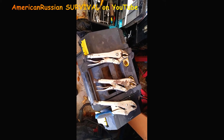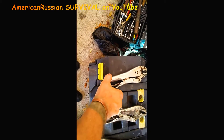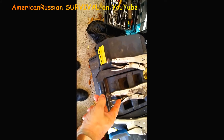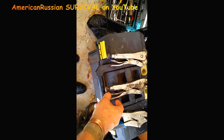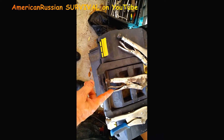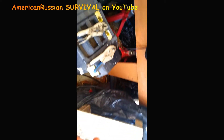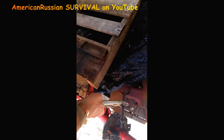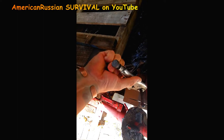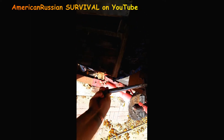Here's a little trick with vice grips. Sometimes when you're clamping them down you have a hard time releasing them with the lever. This one actually bent out even more because as you use these and clamp them down hard, sometimes you have to put a lot of force to open them up, and it starts bending this arm — making it closer to the other side and reducing leverage. So if you had this clamped down tight you might have a hard time opening it. I bent the lever a little bit and put it on there kind of tight.